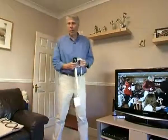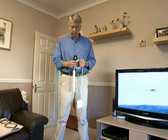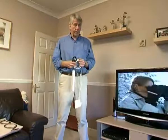I've come to a typical family home with quite an old electrical installation, which doesn't meet the requirements of the 17th edition, especially with regards to RCD protection. And I'm going to measure the functional earth leakage currents produced by different bits of equipment to see what kind of issue might arise when this house is finally rewired and brought up to date.